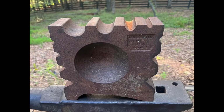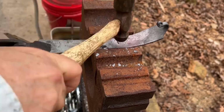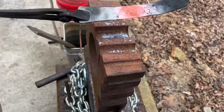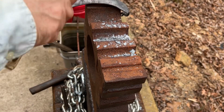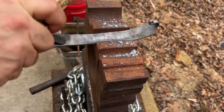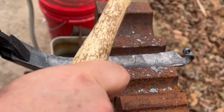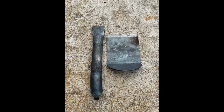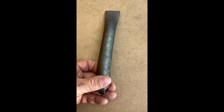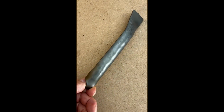To form the handle into the shape we want, we're going to use a swage block. Then using a ball peen, we hammer the handle down into that U-form. This stretches the steel, causing the handle to start to bend up. Lightly hammering it against the swage end in the anvil, we straighten it back out. Then back to the swage form to finish, checking the shape and adjusting as we go. After rough forging, they're soaked in vinegar overnight and wire wheeled to clean them up. And this gets them ready to be assembled.